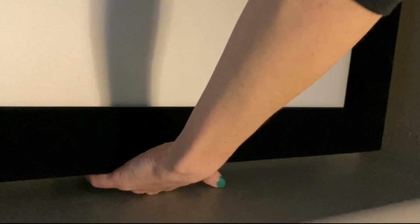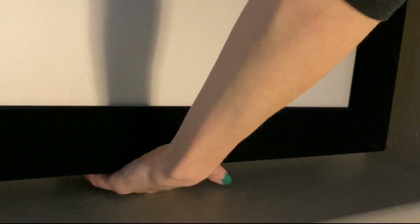While the screen is hanging on the 2 top brackets, slide each of the bottom brackets to align them with the bottom screws. Lifting one side of the screen frame at a time, make sure the top and bottom mounting brackets lock onto the screen.